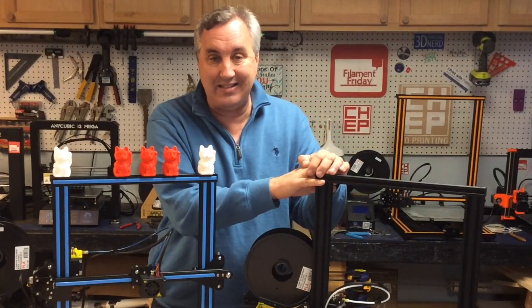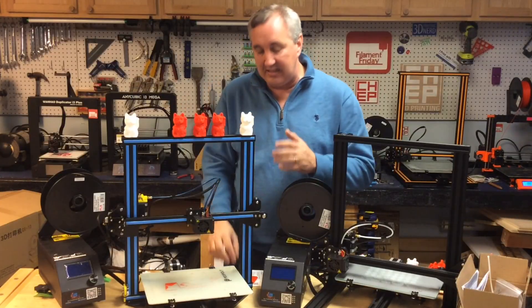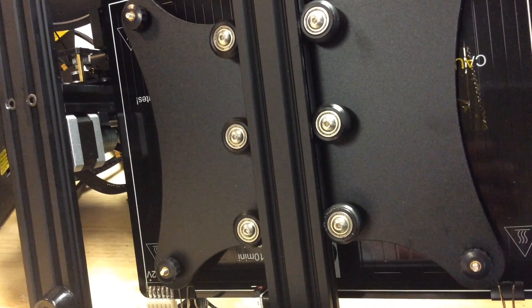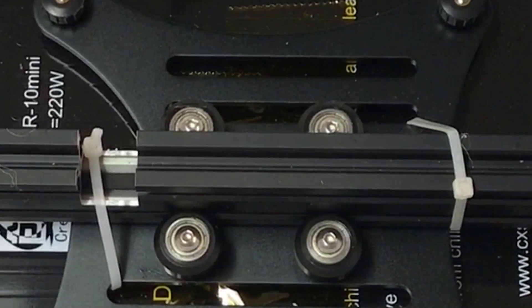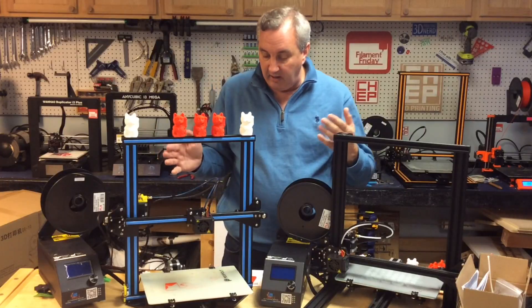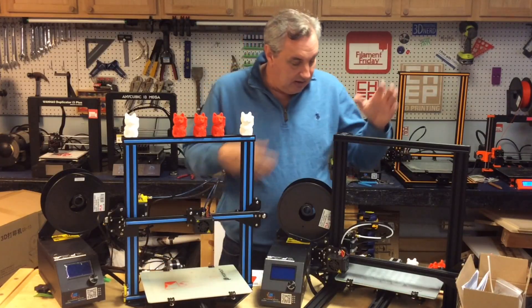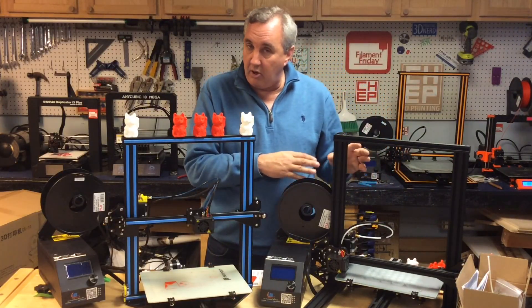The CR-10 Mini has been running like nonstop for two, two and a half weeks, 24/7, no issues. The acrylic version I could not get a consistent large print from — small prints were fine, but larger ones the bed just gave me all kinds of problems. The CR-10 Mini has six wheels and a flat aluminum extrusion; the acrylic version has a standing-up aluminum extrusion with only four wheels, so the wheels are closer together and fewer of them, making the bed harder to level. The acrylic version also has a fiberglass top you can pop off and flex, which might be a nice feature, but it didn't help. The CR-10 Mini has a glass bed, which I love — glue and glass is my favorite way to print and it's more reliable in the long run.